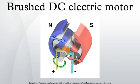The commutating plane, in a dynamo, a plane through the centers of the contact areas where a pair of brushes touch the commutator and parallel to the axis of rotation of the armature, is referred to as the commutating plane. In this diagram the commutating plane is shown for just one of the brushes, assuming the other brush made contact on the other side of the commutator with radial symmetry, 180 degrees from the brush shown.